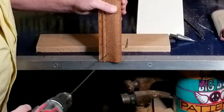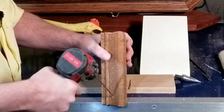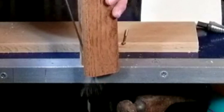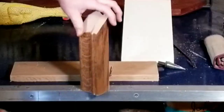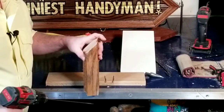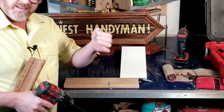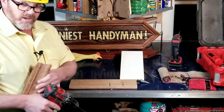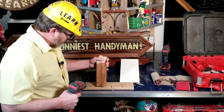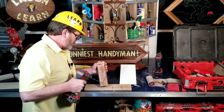When you're doing handrails, I try to stay away from doing anything up at the top because it's just so obvious. Nobody ever really looks underneath along the bottom. So let's get our first screw about an inch to an inch and a quarter from the edge. The reason I'm doing three different screws coming at three different angles is to take our joint into a much stronger space. Obviously you would not typically want to use a small 2¼ inch trim head screw to install a handrail, but there are times where you literally have no other option besides charging the customer a small fortune to rip apart their walls. This is a good way to save your customers some money and still come out with a nice strong handrail.